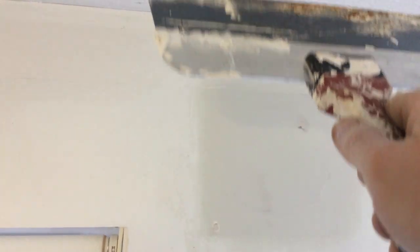When this dries it's just so easy to sand - it's lovely to work with. That'll dry nearly pure white. Maybe not tomorrow as it's freezing up here and there's no heating, so maybe a couple of days. But once it's dry, same process - get a nice coat over with the knife and taper it all out, so you won't notice it. An important thing here is to come way past the edges with the filler, so come down to a large area and basically skim that whole large area. We'll show you how that turns out once it's dried, sand it again, and then same process.